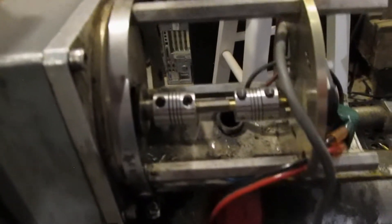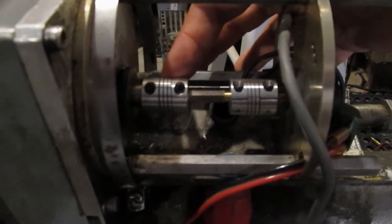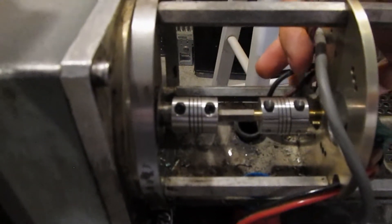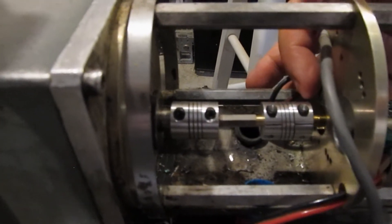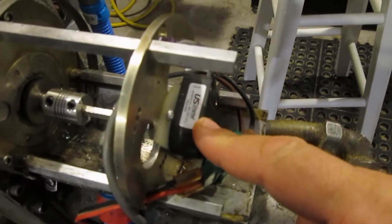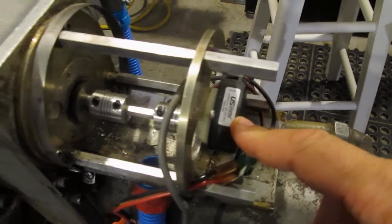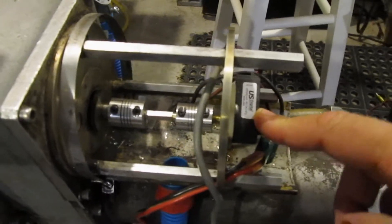That's the digital encoder. So what I did was I put in these misalignment couplers. I was going to originally put one in, but I had to make a piece to fit here anyway, and I decided they weren't that expensive, so I put two in. Then I made a coupling shaft. This is the digital encoder I'm using — it's a 500-line encoder — so I really get a lot of accuracy out of the machine this way.